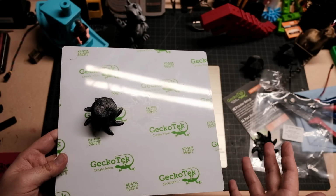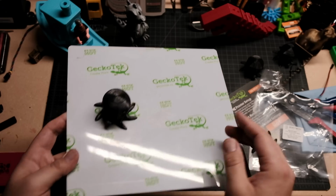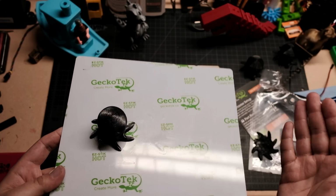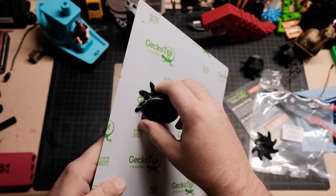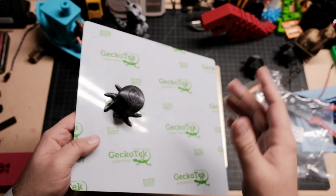So now we need to see if it comes off. I mean, that's been the issue so far. We've already damaged the plate from our PETG, and then I ran the PLA and it just took more off. It does print on there. Again, the PLA didn't warp, but let's see if it comes off. I do have some leverage here to come underneath, and nope, we're going to have to go back to the technique I used to take this one off.